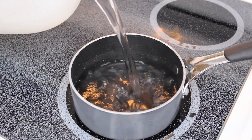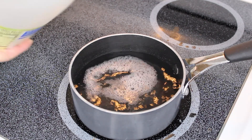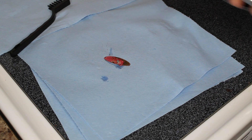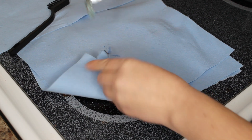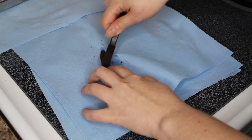Some of the chairs have the original Maker Mark plaque on them, so to clean those up I did a vinegar boil. I just boiled some vinegar, dropped the plaques in, let them boil for a little bit, then pulled them out with tongs and peeled the latex paint right off — it came off really easily. I then polished them up with a nylon brush to get them all nice and shiny.